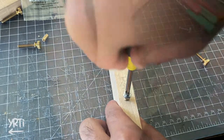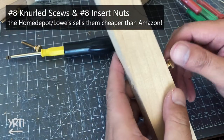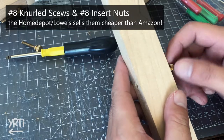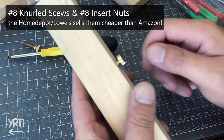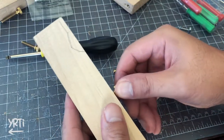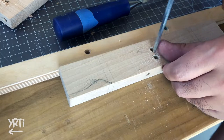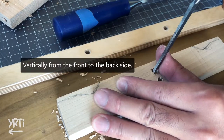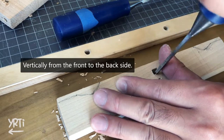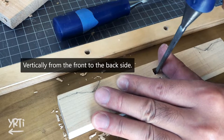Working on the handle and clamping function. The reason I put this insert nut first was that the insert nut breaks easily before going all the way in, so I just wanted to be sure this goes well. Then I made a mortise for a cutting insert quickly. The mortise has 1mm leeway on the vertical way for easiness of putting the cutter and fitting a depth adjustment nut to the slot on the cutter.